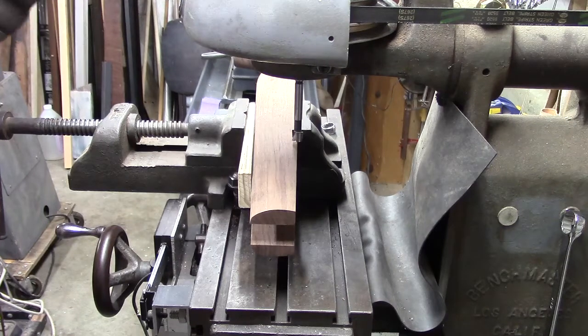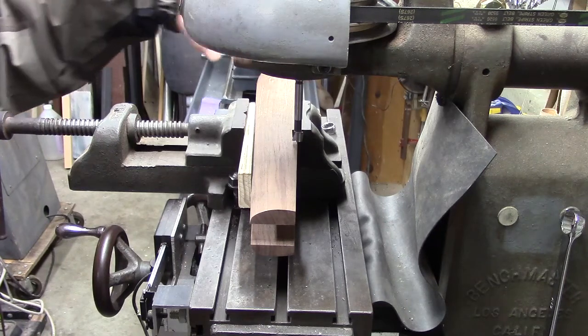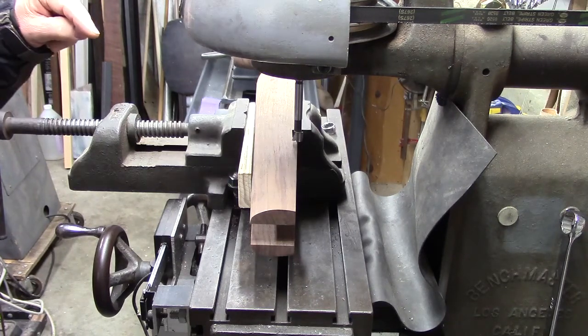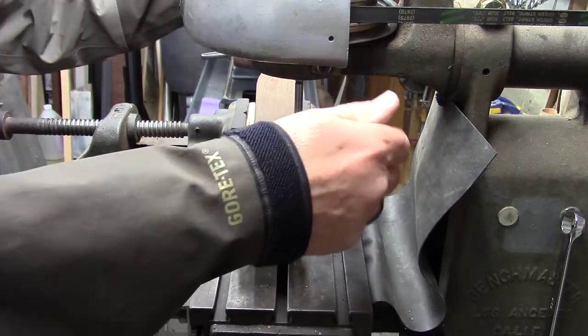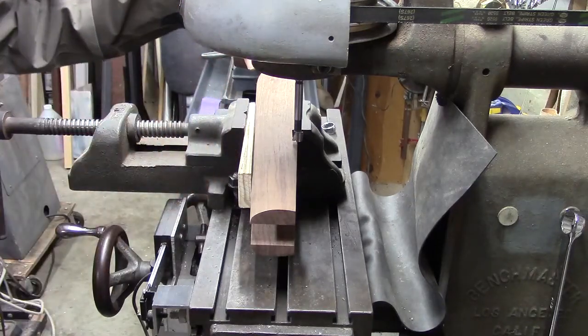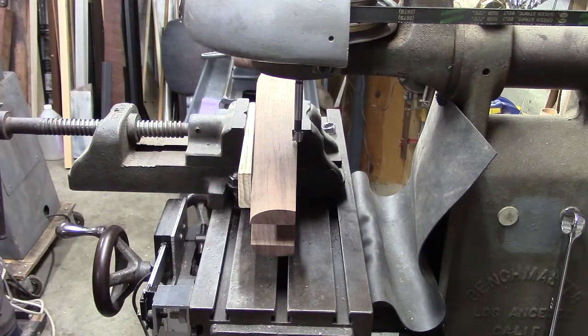Sure, one could remove the bolt, but that's a lot of unnecessary effort. I like to align the bolt heads and nut slot - the screwdriver slots - vertically, and then put the action in here but hold the aft end up so that the steel is parallel to the wood the way it'll be when it's down in there. So you don't have an angle. Make sure it's flush against the back, then mark it on both sides, quadruple check it several different ways, and make sure you're really happy with it - because there's no way to put this material back. And now we'll go ahead and make this cut.